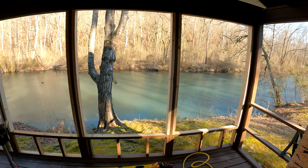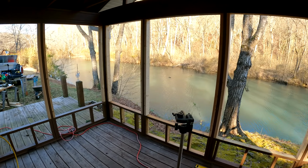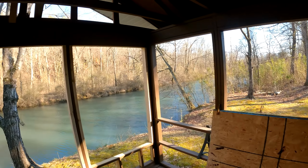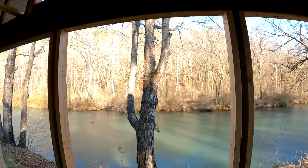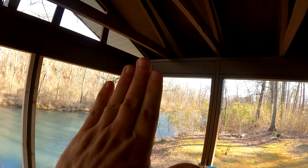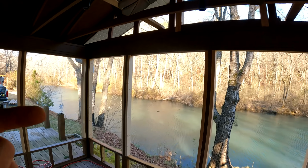So I got all four of these done out here on this outside. Those three. So one, two, three. These four, seven. These two will be the last two. And then my one up here makes 10. I still got a little bit of work to do. I need to frame all these in, so I can trim it out and then insulate behind it, similar to what I did over here. I gotta do those. And then I will need to sheet the outside.